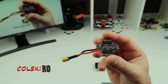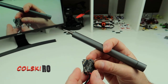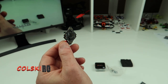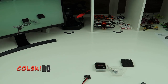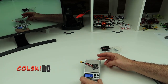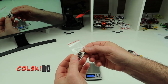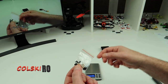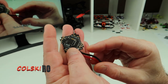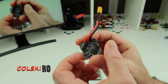You need to be careful what frame you're putting this into to make sure that USB port is going to fit. It is compatible with a buzzer, which I'm probably not going to use because I want to save weight, but it's quite unusual to have that on one of these boards. It weighs ridiculously low amounts — let me get my scales. It's coming in at six and a half grams, including the XT30 connector, with less than a gram for the standoffs and small connectors. If you're not great at soldering, the easiest approach is probably to use the pins rather than soldering wires, as bridging them is a real risk.